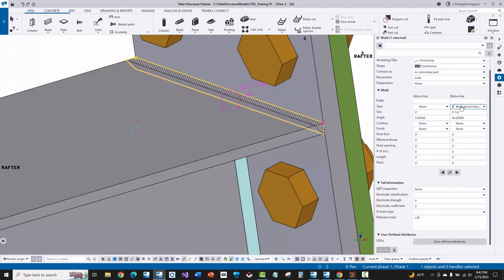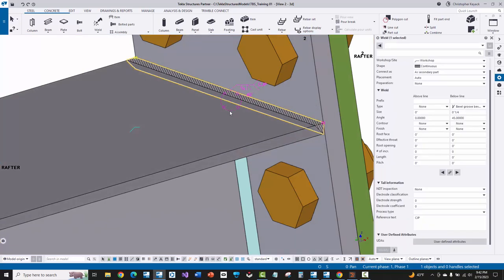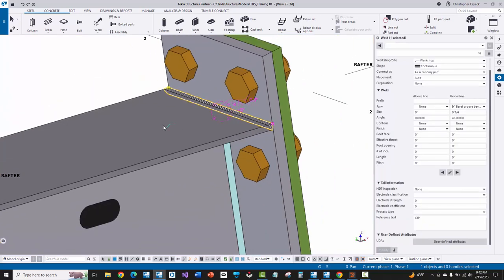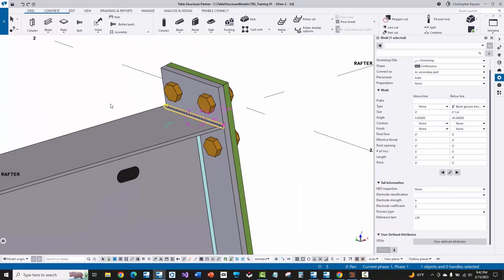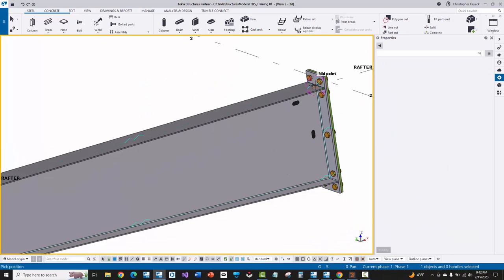MBS isn't putting in the 45-degree angle, the root opening, or even the weld size for the prep at all. This is something I've just manually done after it's imported in from slide rule into Tekla Structures. So that shows you a few different conditions.